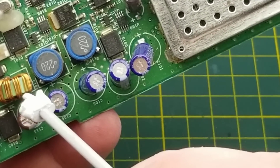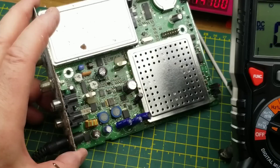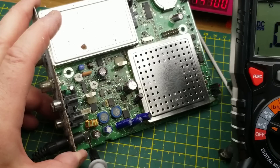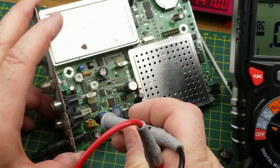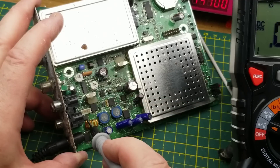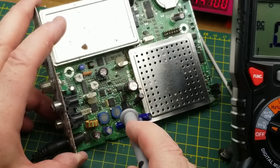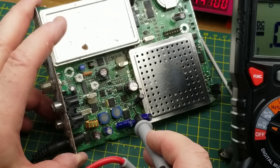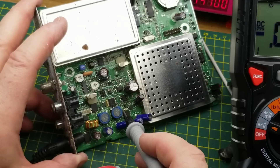I'm guessing there is some sort of active power supply happening in here. The three big diodes I found are Schottky diodes. This one here is a BJT power transistor. These two are both op amps, so I don't think they're part of the power supply circuit. But this little 8-pin and 6-pin, and then the same two chips, probably are.